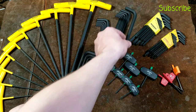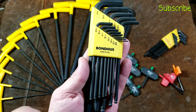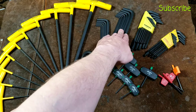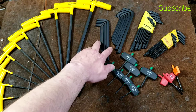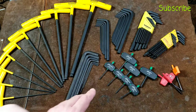One disappointment about this security L-wrench hex key set was that they were much smaller in variety than the traditional style. The current standard imperial hex key set is 13 pieces; older ones were 12 pieces without the 3/8. But the security L-wrench set is only 8 pieces, and the metric is just 6 pieces — I was disappointed the metric wouldn't even come with a 10mm, considering how expensive these L-wrenches are. Security L-wrenches are recommended to get with a warranty like Bondhus', because the hole makes them not quite as strong and they can break a little more often.